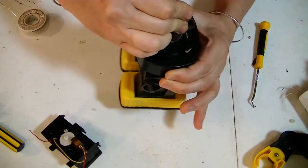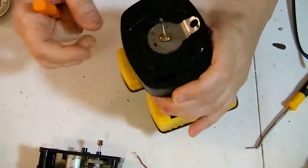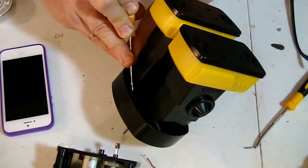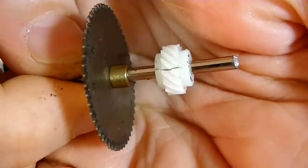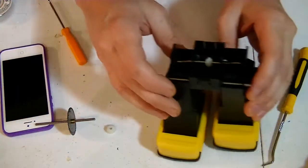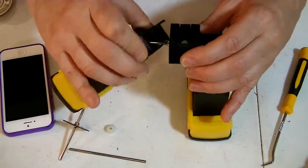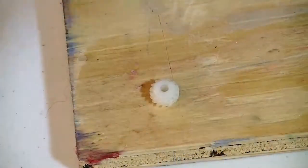it tries to turn, but it feels like a gear is slipping at times. Looks like this thing has tabs in there. And I'm either about to break this thing or I just figured out how you get into it. Yep, this gear has a nice big crack down it. This one inside as well, you can possibly see. That one came off really easy. That one's definitely the one sliding. See, pop this pin out of here. Okay, there it goes. Alright, let's give this a shot.